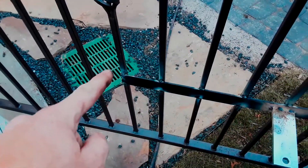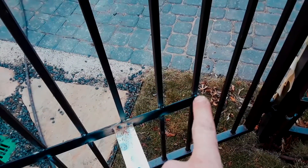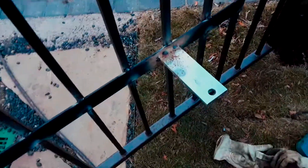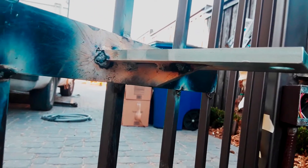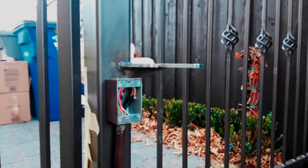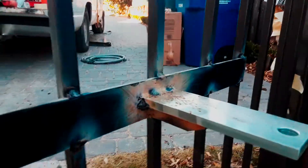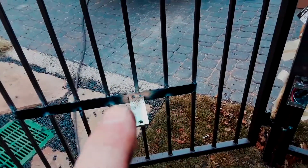I welded all the pickets, welded down the side, welded all the pickets, and welded down that side. Then I put little tack welds all along the back to help add support, and I've added a gusset here too. Those are pretty inconspicuous so you really won't notice them, but I felt it needed it for support. That's the welding done on the gate — I'm going to brush this up and all the welding on the gate for the support arm will be finished.